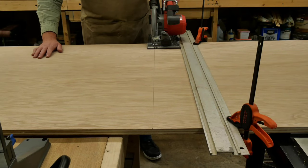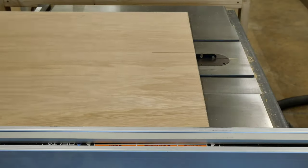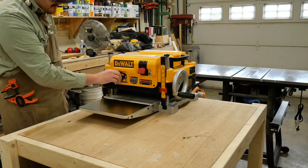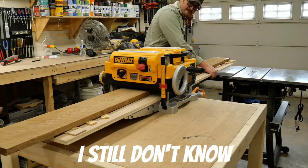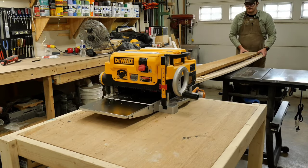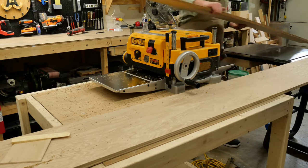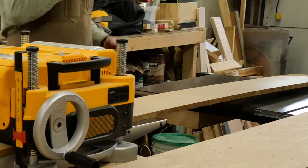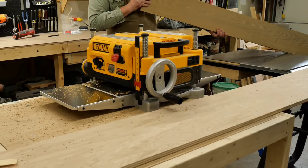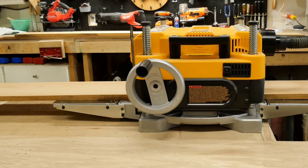After the drawers were done, I broke down a sheet of three-quarter-inch red oak plywood. I'll be using this for both the sides and the top of the chest of drawers. After I got the three pieces cut down to their correct dimensions, I moved on to planing. I started first on a piece of mystery wood that I used on the beds last time. This one board was so badly twisted and warped and cupped that I had to place it on a sled with some shims to get it planed correctly. If you do this step without the assistance of the shims and the sled, then you just end up planing down the thickness of a really badly shaped board, meaning that it'll just retain the shape of the cupping, instead of actually flattening it out. Regardless, it took quite a few passes through the planer to get it to a workable state. But once it was done, I proceeded with the other pieces of oak to get them down to the correct thickness as well.